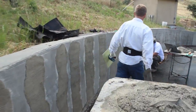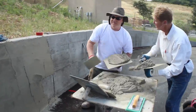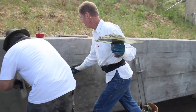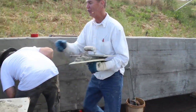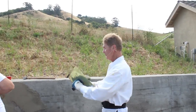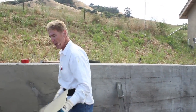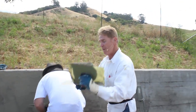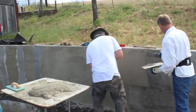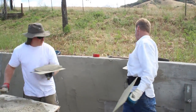So, all right. Now, Nathan over here, my brother from another mother, what we're doing basically is we're just putting on this coat here. I'm taking Jay's job now, because these are his tools. He's spreading, but he hasn't learned yet to spread and fill. So what we're doing basically is we're putting on a little bit more. Fill that board up, Lou, because you know I don't mess around. All right, what I do, guys, is I'm taking it up, because after I take it up, I want to shave this top.